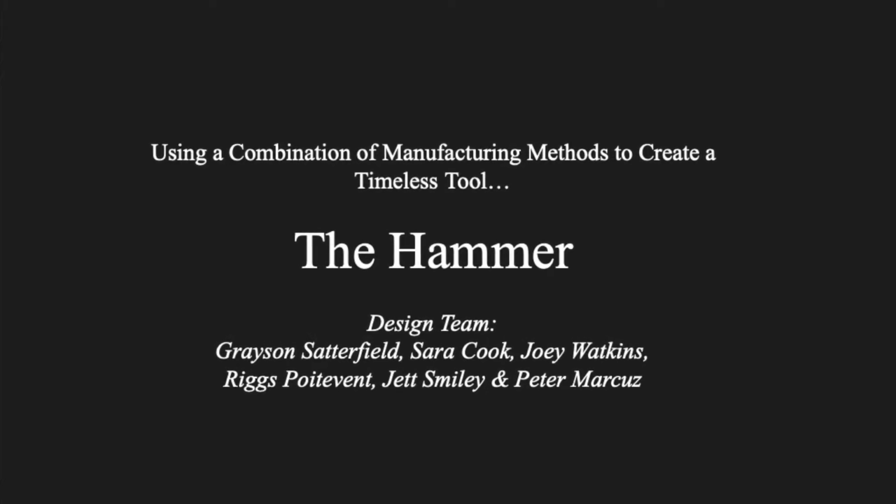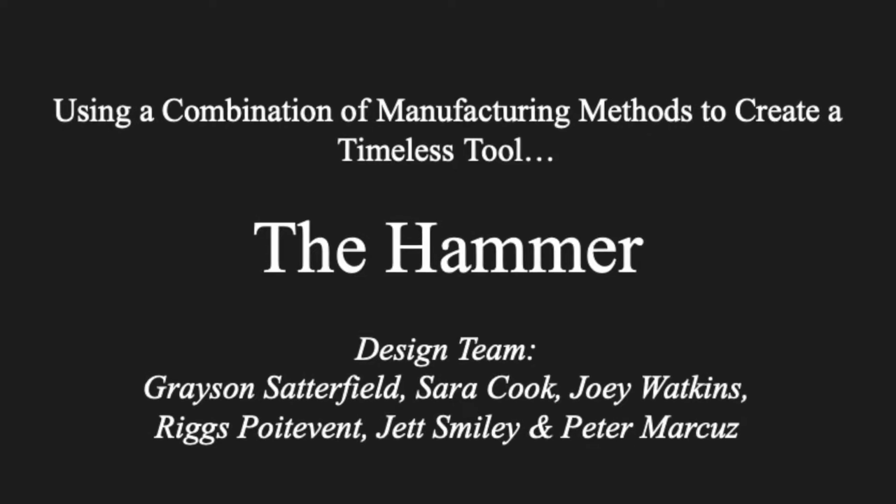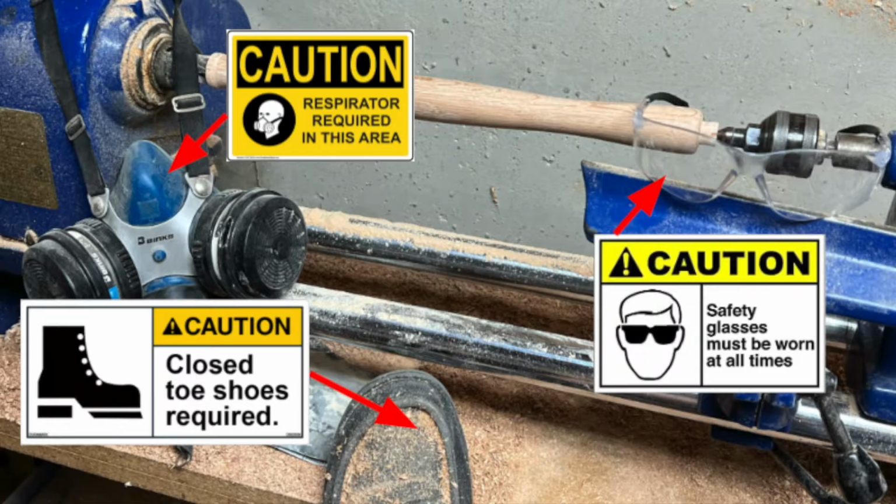For our project, we use a combination of manufacturing methods to create a timeless tool, the hammer. To create the hammer handle, we use the turning method. In order to stay safe during this method, we made sure to wear a respirator, closed-toed shoes, safety glasses, and made sure not to have any gloves or loose clothing around the machine.